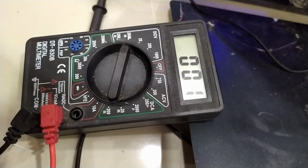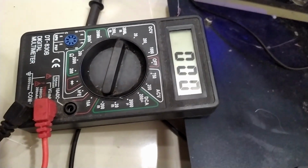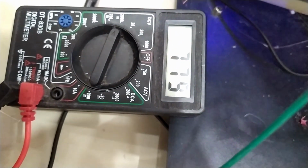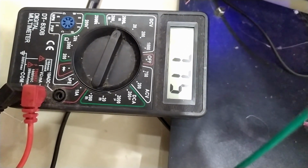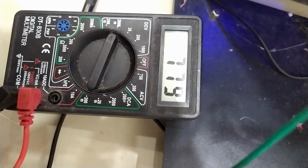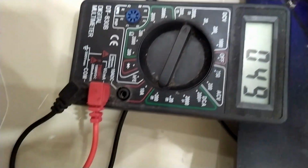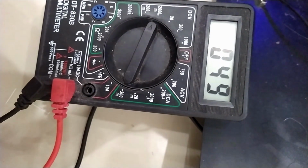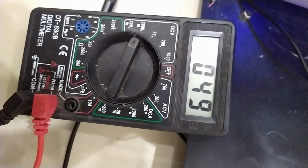Hi guys, I think I just found the real cause of my uneven Z layering problem. Okay, so if I probe Z2 here, as you can see, it has an output voltage or Vref of approximately 0.7 volts. Okay, and now if I probe Z1 over here, you can clearly see that it has a very low Vref value of 0.049 volts compared to Z2.